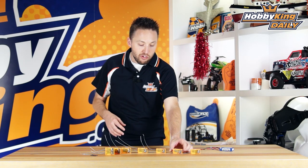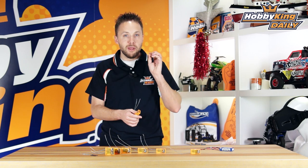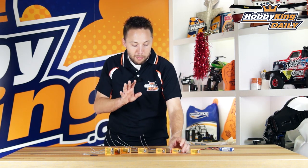With any of these models, regardless of the channel count, the number in the name — so the 620 being six channels — is actually referring to how many physical PWM outputs there are on the receiver. That means the 620X has six physical channels you can connect your servos or other devices to. But because they are CPPM or SBUS capable, that digital signal protocol can actually output more channels than what is physically on the receiver itself.